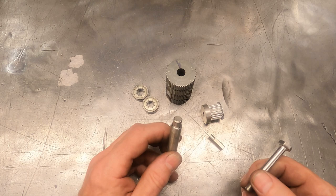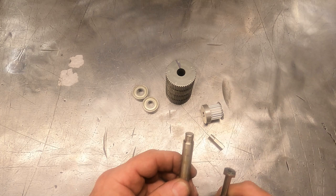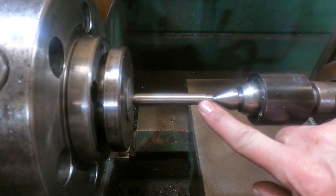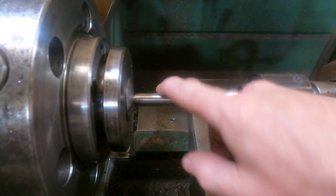We're going to have to put the collet chuck in, which is always a pain because the regular six-jaw weighs a ton. So we'll set that up. This should be a pretty straightforward operation - just drilling and tapping one end of this stainless shaft. Stainless is going to be a pain to tap. There are some ridges on the shaft from where it was driven in, so we're going to fire up the lathe and stone those down to get them as smooth as we can before putting it in the collet.